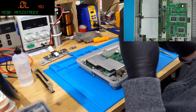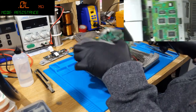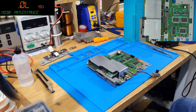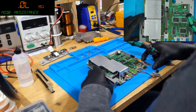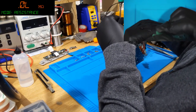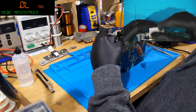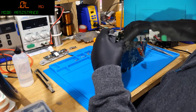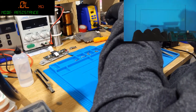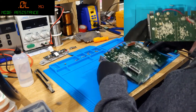Yeah, I have no audio. Image is perfect. No, it could actually be the sound chip. Those do fail. It might not be your caps. It might be the sound chip. If you need a sound chip, I have some going spare. In fact, I have a whole load of them because I've got a load of dead SNESes. So, if you want the sound chip, let me know. But you can try your caps first. See what that gets you. You never know. It might do the job. Now, you can test caps in circuit, you can do that.